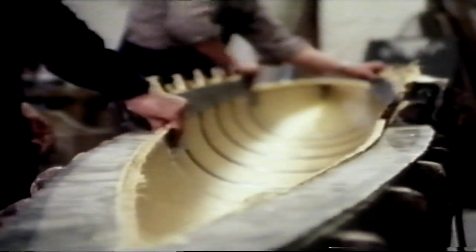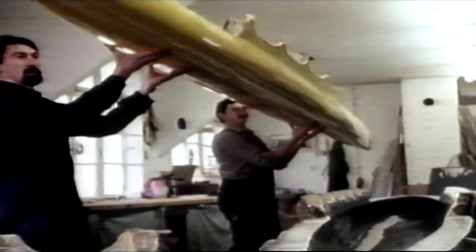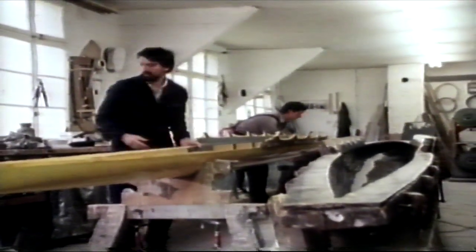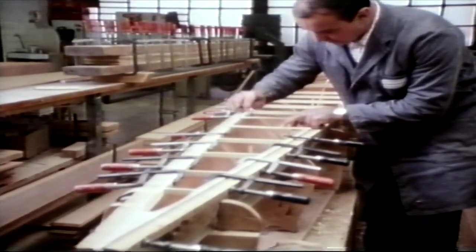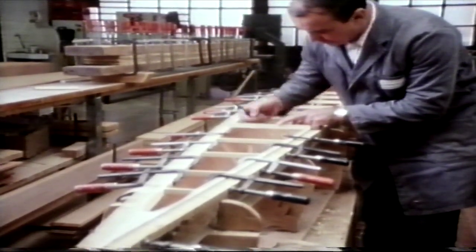The hull is then de-moulded. It is stiff and can support and sustain most of the torsion and the tensile and compressing forces created in rowing. In a wooden boat, these forces are absorbed by the inboard construction of ribs, cross supports and diagonals.